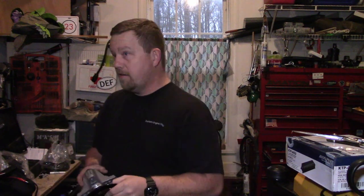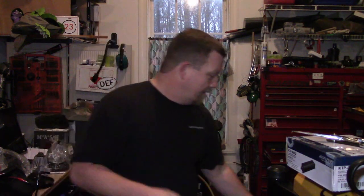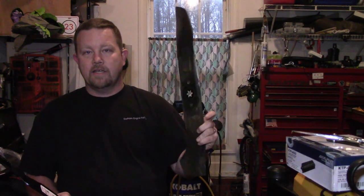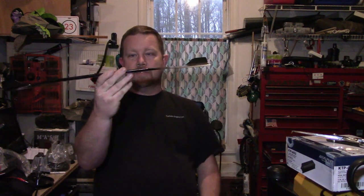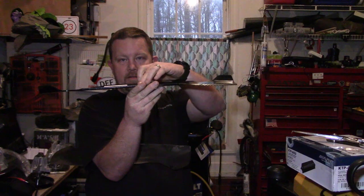This new one has the nice little zerk fitting. I'm going to go ahead and install these. Probably around July or August I'll revisit when the blades need resharpening. In the kit I received, these are the factory Cub Cadet blades — the part number cross-references as a replacement. You'll notice on these blades they're sunk down a little bit with a lip, and the blade slopes down slightly, so note which way the hump faces to ensure proper clearance.